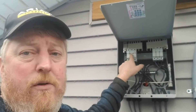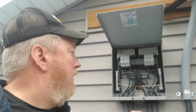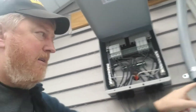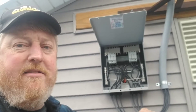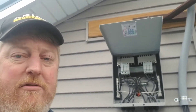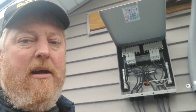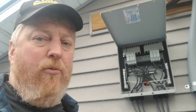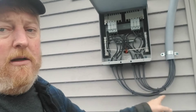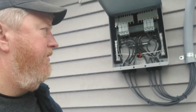These are using 15 amp 1000 volt fuses, with strain relief at the bottom. I get asked a lot if you can come in the top — and while you could punch holes in the top and put strain reliefs up there, in theory they'd be waterproof, I'm not a big fan because it's just one more way for water to get in. I like making that drip loop like that, so if any water does chase down, it drips off and doesn't get in anything.